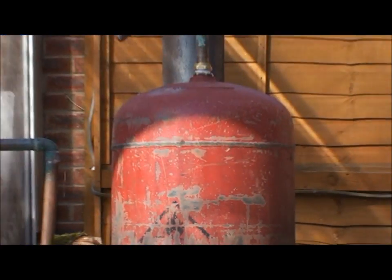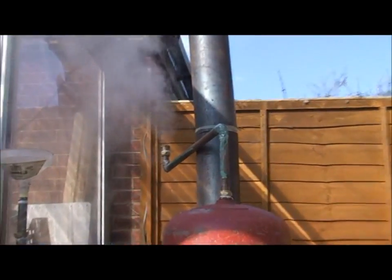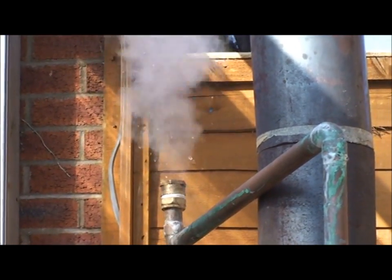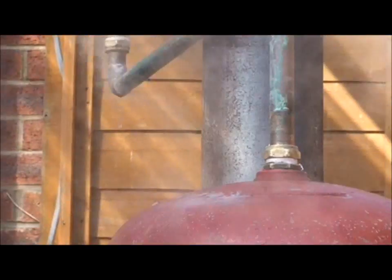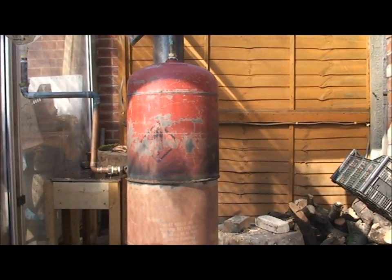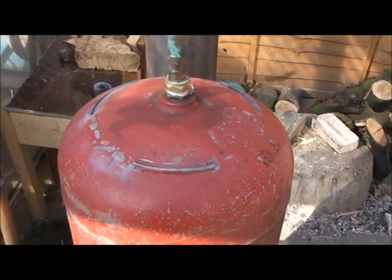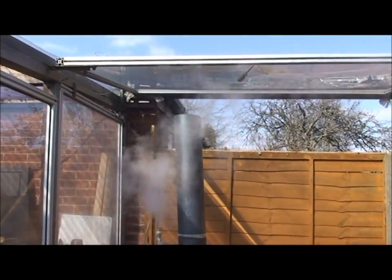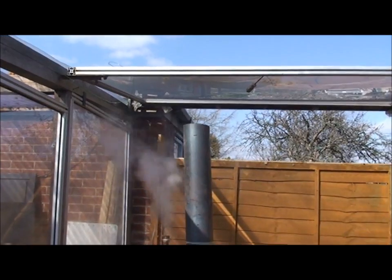So there it is — I now know the boiler is successful. If that was connected up to my little tank there'd be a really good flow of water moving through it now, and it would have heated up much faster than the previous setup. I think because the boiler is now contained as part of the stove body, the heat inside is much greater, and obviously the outside of that jacket will be hot at boiling temperature. With the riser changes, the vortex, and secondary air, there was a clean burn almost within 30 seconds to a minute of lighting the actual stove.